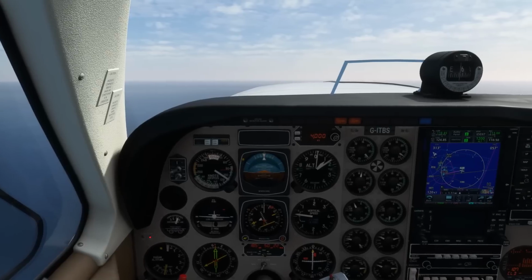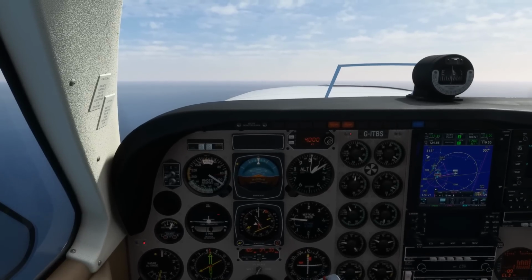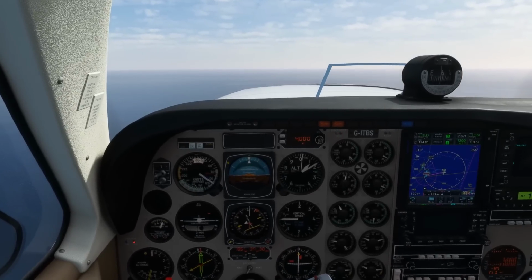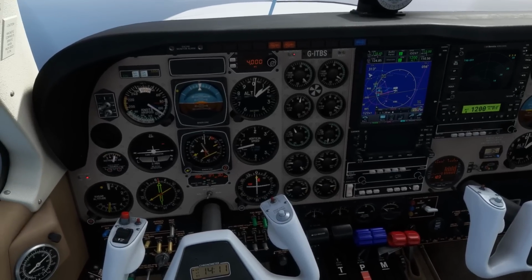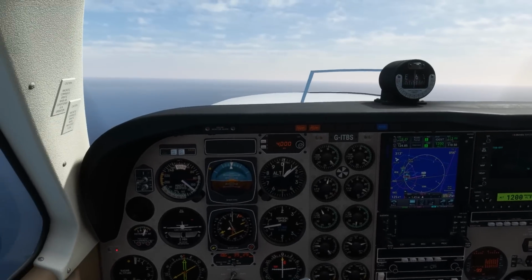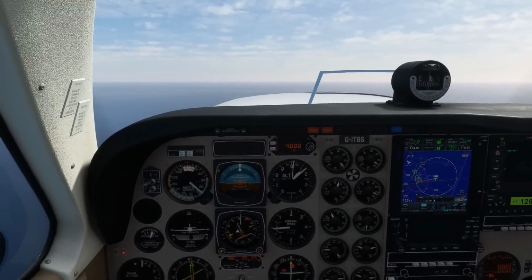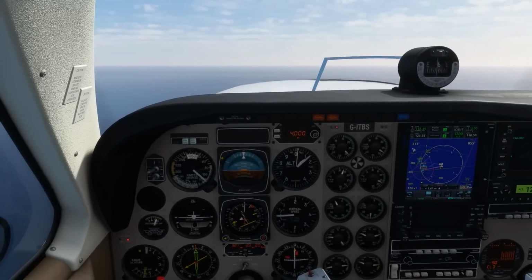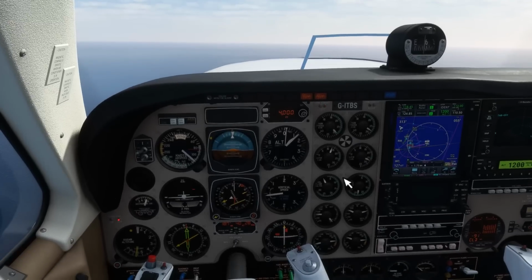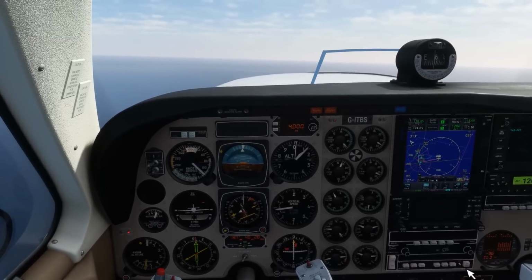Okay, so the aircraft now more or less in balance. Just pitching to make sure we keep above the blue line there, 100 knots. And running through our memory items: mixtures up, pitch up, power up, gear up, flaps up. The dead leg is our dead engine. At the moment, my left leg here doing no work, we've got right rudder, so identifying the left engine and confirming that there with the engine instruments.